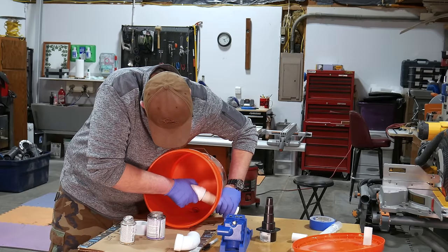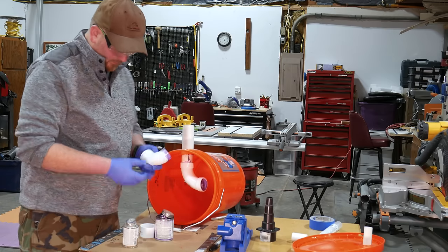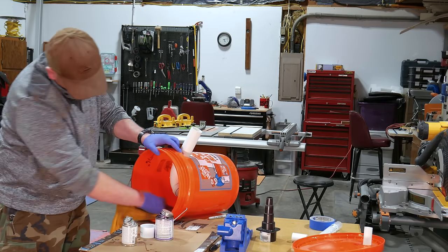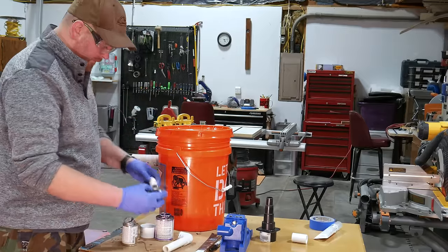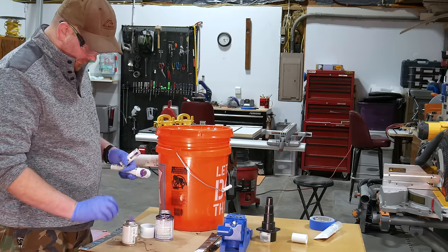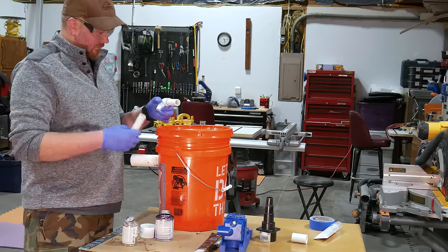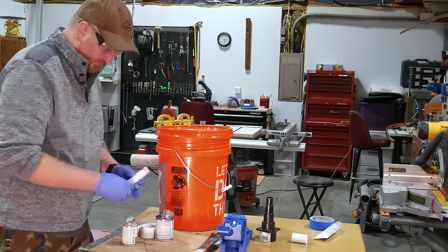Be sure that the mating surfaces on the PVC pipes and fittings are clean and dry. Next, dip the applicator in the primer and swipe it all the way around both mating surfaces on each section of PVC you'll be connecting. There probably is an ideal wait time to let the primer dry — it's probably listed on the can — but for me I wait exactly long enough, which is about as long as it takes to put the applicator back in the can and grab the cement. Then essentially repeat that same process with the cement, covering the entire mating surface of both pieces. Move quickly — the cement sets up really fast. Then press the two pieces together and give a quick twist, about a quarter turn, to make sure the cement is evenly distributed. Hold both pieces for a few seconds to give the cement time to set up, otherwise the pieces may slide apart.